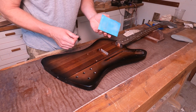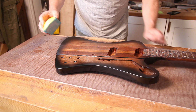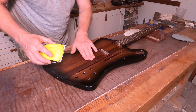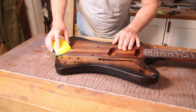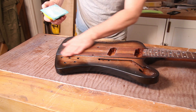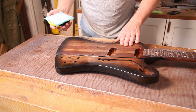To start with, I'm going to take the 600 on this block and just give it a quick rub down. You can see there is a little bit of texture in this, but mostly that's smoothed down with just that little bit of rubbing. Those of you who've been following this might remember I actually built a spray booth and had an extractor for the first time while spraying this, so there's hardly any overspray. It is rubbing down quite easily. I'll do that until everything's down to a nice flat finish with the 600, then step up through 800 and 1200.